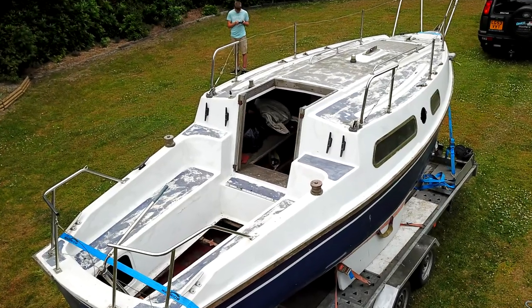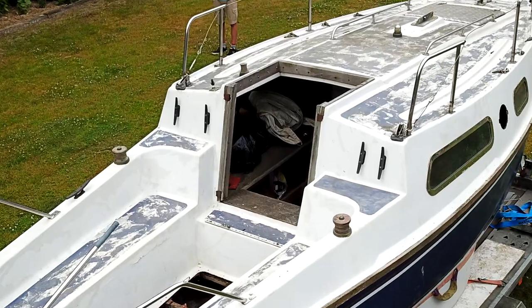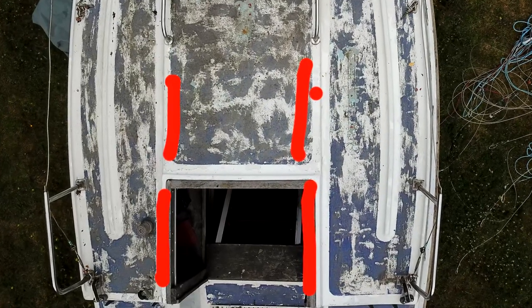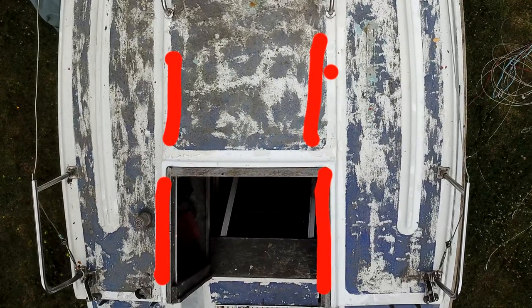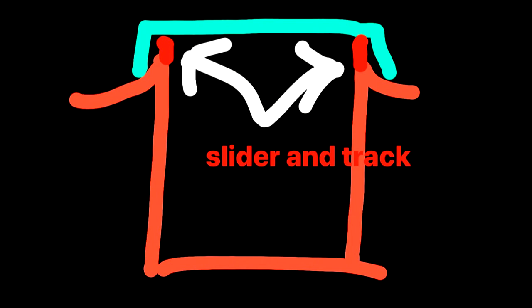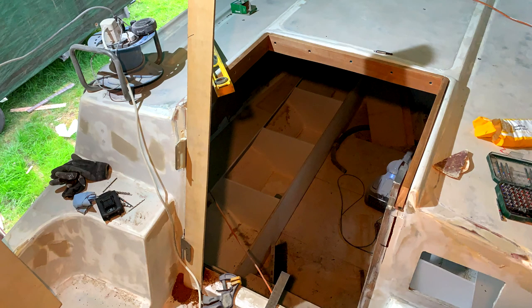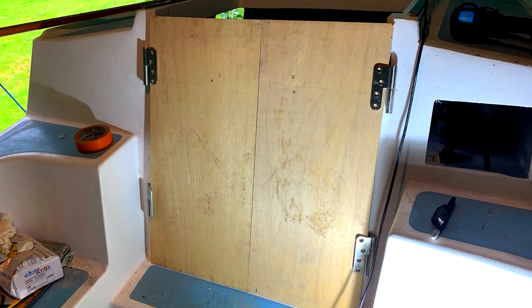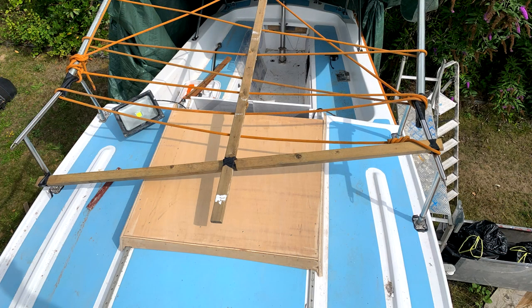Now onto the companionway hatch. I had to solve the problem that there wasn't any hatch, so I made up a plan. The main issue was getting a sliding hatch - a raising hatch wouldn't make sense on such a small boat. A few episodes back when we did the deck paint, before painting I fitted the lift-off hinges and mounted the doors for a test fit, as I knew I was going to do the sliding hatch. With the doors fitted I could work out the interface for the hatch, make it out of marine plywood, screw some bits together and make it fit over the two different level changes.